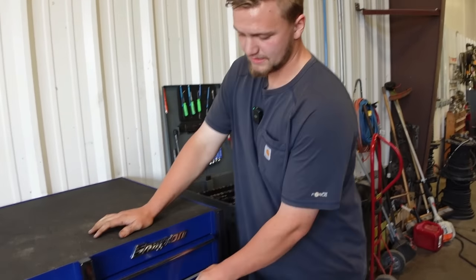You don't just scrap the truck? No — engines and everything in them is valuable. Trucks are expensive. This is another trunk drawer — studs, caging bolts to cage a brake can. A caging bolt — when you push your brakes, air comes to the brake can and pushes a rod out to engage the brakes. If something's broken in your brake system, you put this in and it takes that brake out of order. Those are specifically made for that purpose.